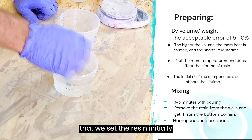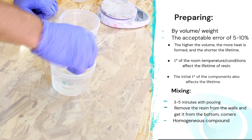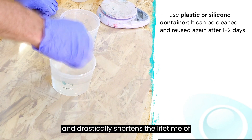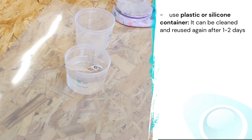Room temperature conditions also affect the resin — during mixing they will either heat up the resin or take heat from it. And of course, the initial temperature you set matters: preheating component A of the resin makes it easier to mix with the hardener but drastically shortens the lifetime of the resin.